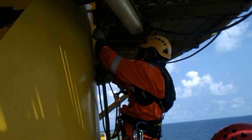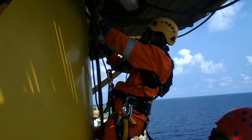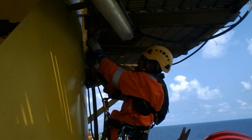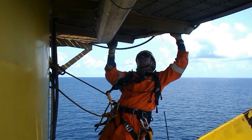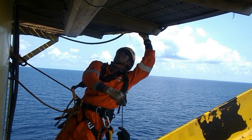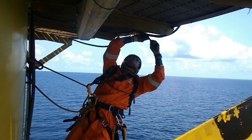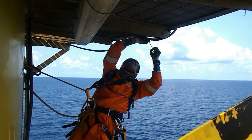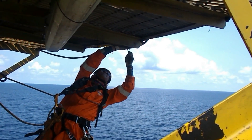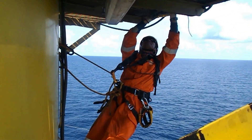In here, the cable has to go up and underneath the platform — so this is the first rope access action on this job. You see the guy climb up just below the platform to guide and secure the cable. He is standing on the stairway handrail, so we are not using working rope yet. He is using the cow's tail for his work positioning, attached to the carabiner to adjust to the necessary length. We secure the cable with stainless steel cable ties, and that is what it looks like after the cable is neatly secured in place.